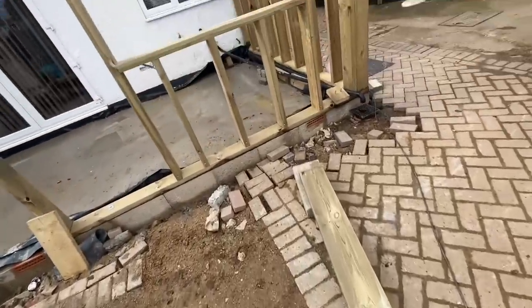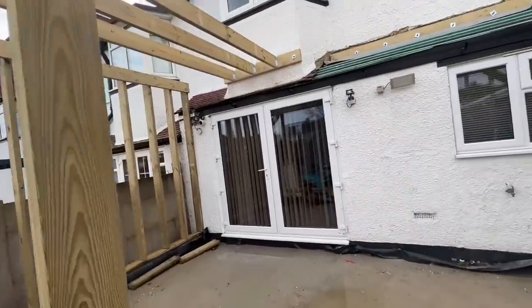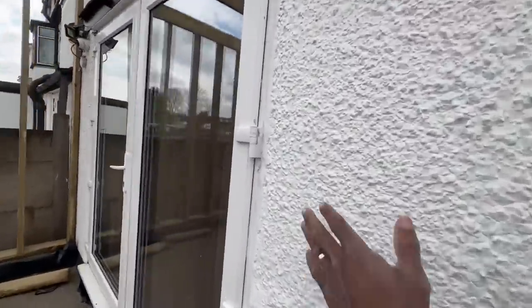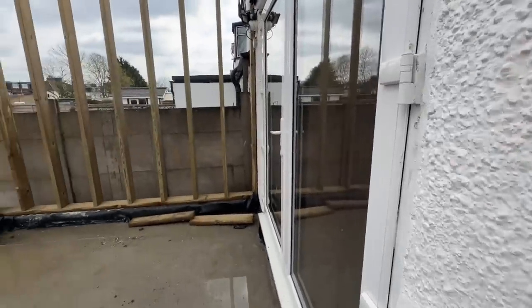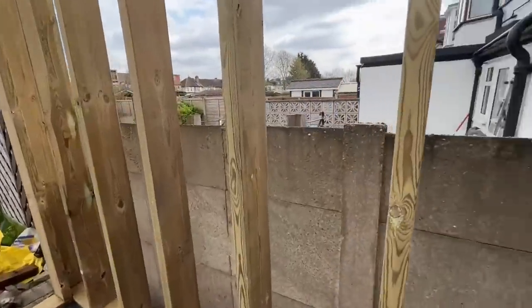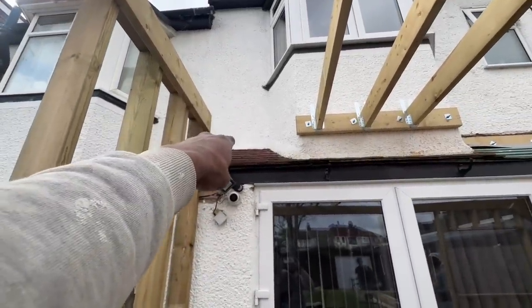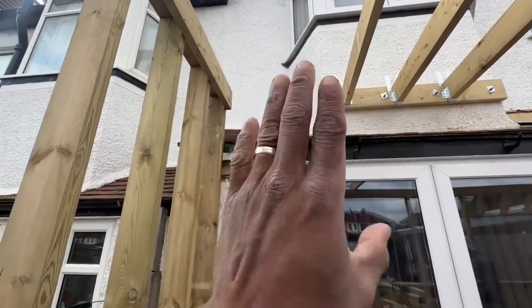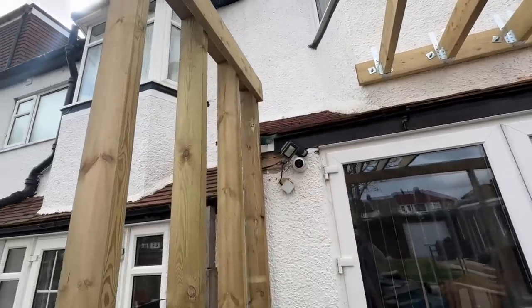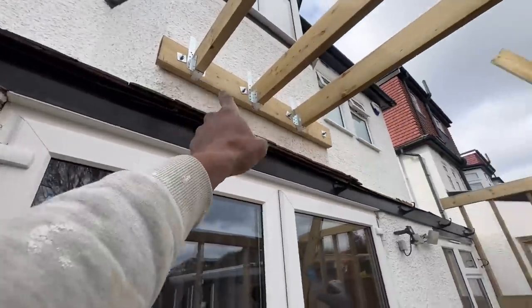So we had to pick up some more. I made a little mistake on my order of the timbers. You see there we've got a bay window here, and the bay window is pretty much level with this wall here. I took my measurements for some silly reason from the wall to there, and really I should have taken a measurement for the rafters to that part of the wall that goes right back. So it's another about 80 centimeters further back. So our rafters, as you can see, like this one, they're too short. These ones were fine, we managed to get away with these ones here,